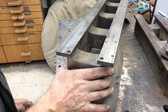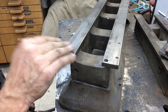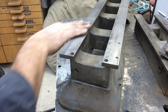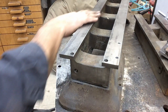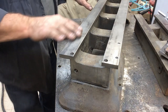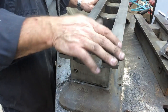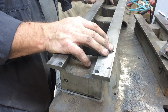For all intents and purposes, this bed machining is done. I'll go back and double-check everything, make sure we're level when everything's bolted in place, and check these holes. I'll go ahead and mount the gearboxes and the things that mount on here - this is for a banjo, I believe. We'll check everything, then we'll probably sandblast it down and powder coat it. The bed ways themselves I'll double-check - you can actually see on this back bedway the wear mark right in through here, especially in this area, which is kind of where the headstock sat. We cut this section off to shorten it up.